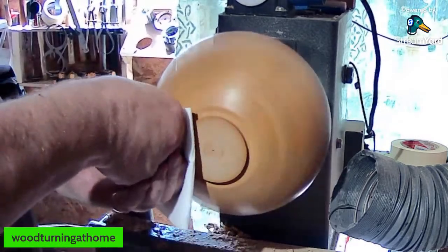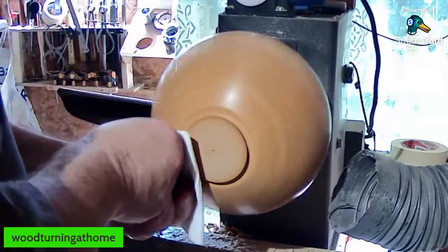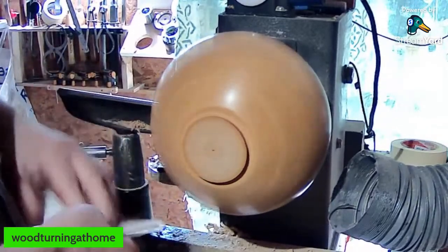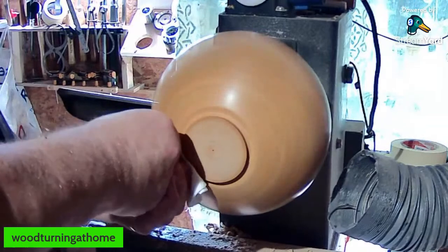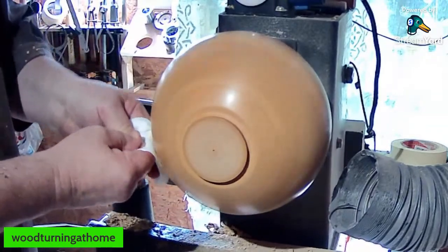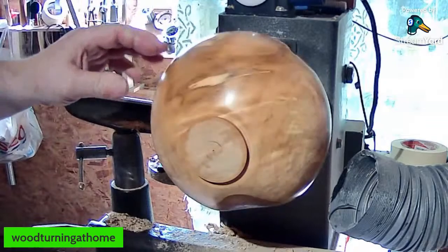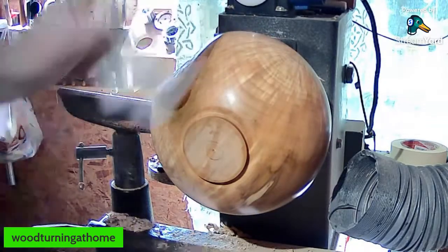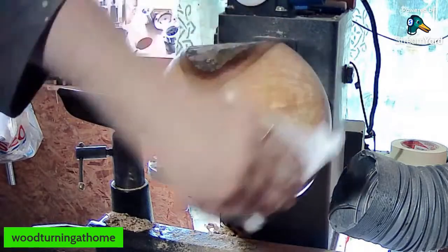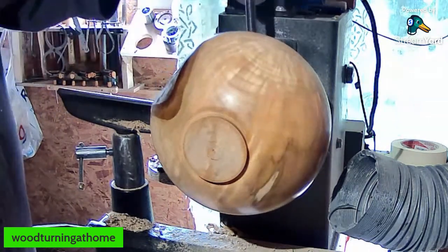We should really leave that to dry for about 10 minutes but we'll buff it off anyway, and give it a coat of microcrystalline wax. We'll get it turned round and see what lies on the other side. The microcrystalline does need a bit of drying time — there's no doubt Hampshire Sheen high gloss is not quite so particular. Colin says he's just got the six-pin drive centre — looks like a good bit of kit. I don't usually use drive centres much; I have step centres which are a multi-purpose tool.